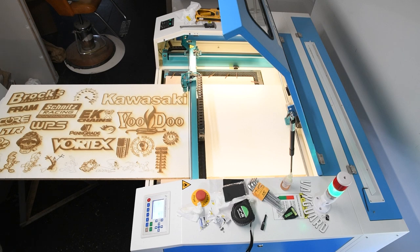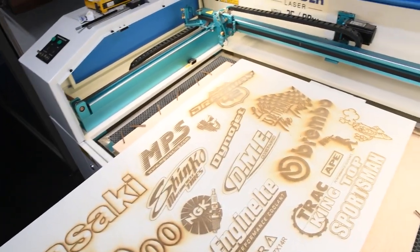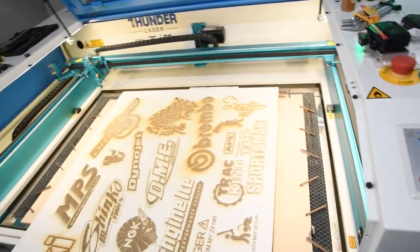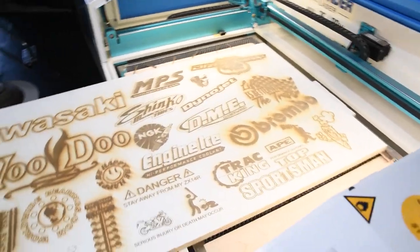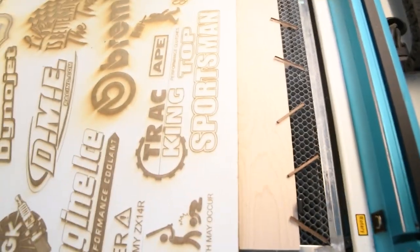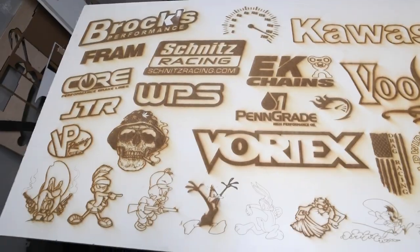Now I'm just going to carry on and do the same thing going this way - once that ends I'll drag it through and that'll be my last cut, done in two more passes. I'll select the designs I want to send over and send them. One warning: if you lower the bed down it's hard to put it back up because with the wood clamped there, the auto focus stops you from lifting it. I'll have to find out if there's a way to override the auto focus. I could still line it up because you can look down the edge, line up these edges, and then use the location feature on LightBurn to make sure you're in the right place.